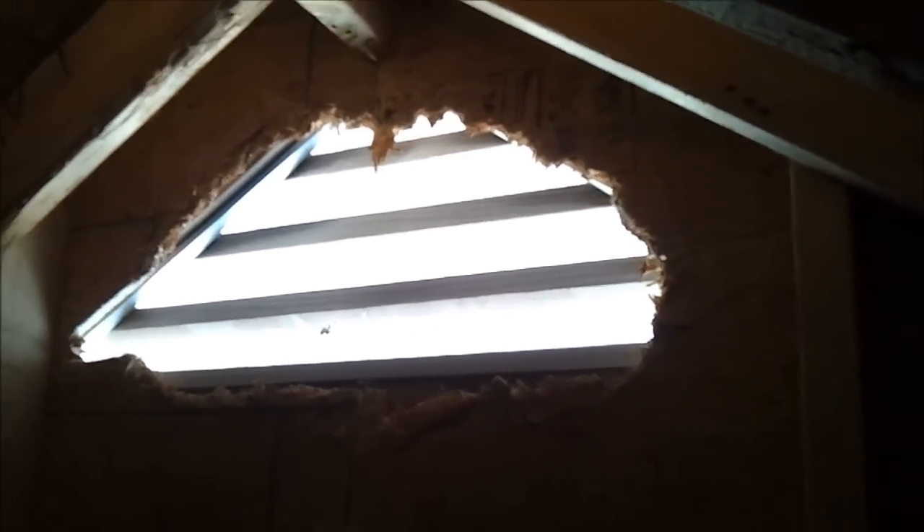Once you have your work area clear, I put on a mask since I did some cutting. Especially if you have any insulation down, you definitely want to use a mask because you don't want to be breathing that stuff. Once you've cleared those 2x4s out of the way, giving yourself some space to work, then you want to go on and take a jigsaw and start clearing these rough hewn edges — make it smooth. The smoother it is, the easier that air is going to flow out.